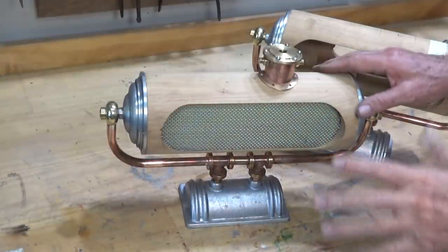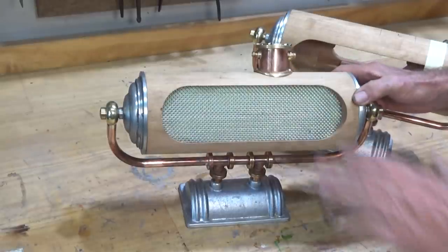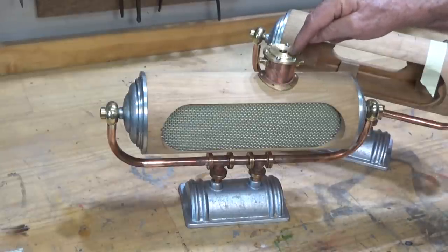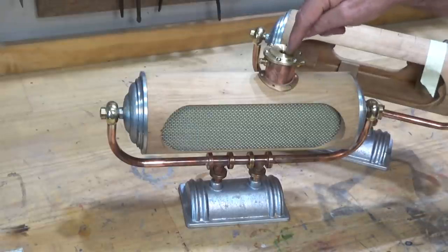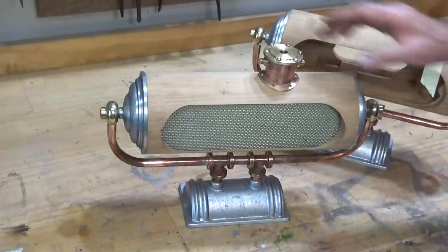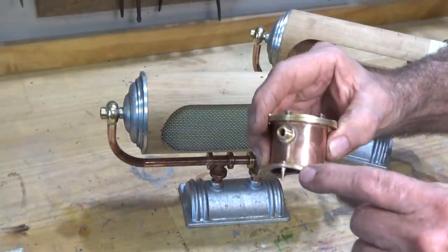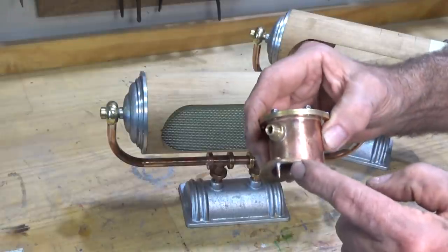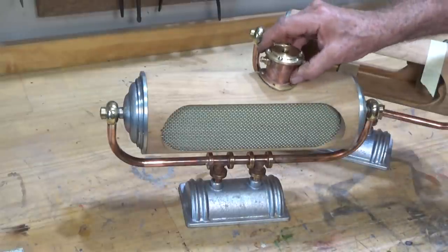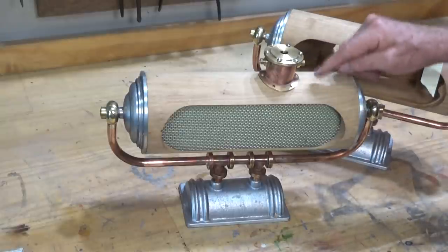Let me get this put together and we'll have a look at the whole clock to this point assembled. I've got both these clocks now sitting on their bases. Although it's possible to tilt it and have the display facing upwards, in reality it's going to have to be positioned so the screen is dead vertical, so this thing is sitting on top of the frame and not canted backwards. You're probably looking at this and saying how did you get those wood screws underneath these bushes? The reality is I cheated — I realized I had the screws in the wrong place. I should have positioned them 30 degrees off that centre so they were gettable, and what I've done is just soft soldered those two screws in position underneath that flange, drilled the holes out oversize so they just plonk down like that, and the other four screws will hold it on.